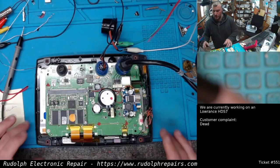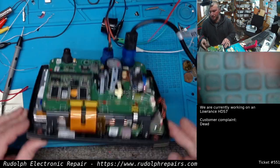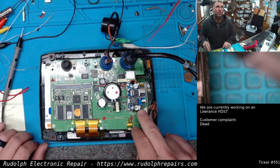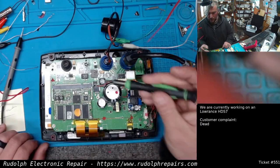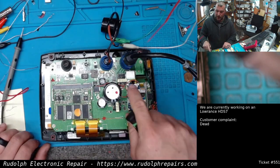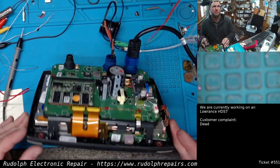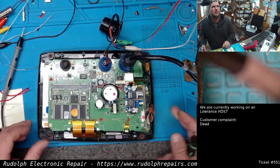Here we go — completely installed now. This is our buck converter. We have our 5-volt line feeding the 5-volt rail coming out around the processor to that pin one. We have the drain from our MOSFET going to the input of our buck converter. We soldered both grounds to the shield right underneath it, which gives us some stability and strength, with a little bit of hot glue on each side. We are good to go.